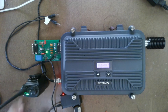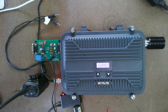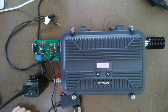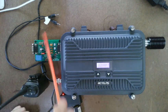I have a red light on here, green light on here, and the repeater is keyed up. We're on a good path. If you do not get the green light, you have a problem. There's no sense going any further if you do not get a green light. Watch my video on the power-on self-test if you haven't done so.